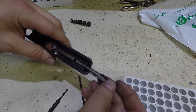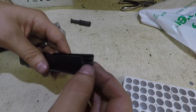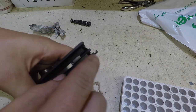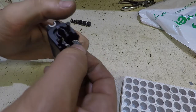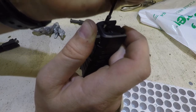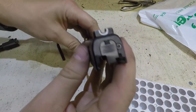From here it's pretty straightforward. I'm going to put my striker assembly back in the back, then put this piece in. This is the circular part that we pressed on at the very beginning. The inner guts only go in one way - you can feel it'll go in further one way than another, and as you spin it, it goes in. You want this little tooth or cutout facing inside because this piece is going to go inside of that. Then I'm going to push my striker assembly down as far as it'll go, put the plate in the back, push the plate in all the way while compressing, and it all just snaps back together.